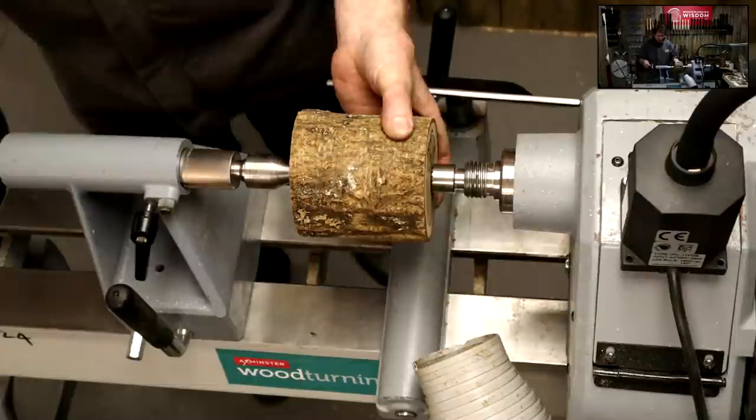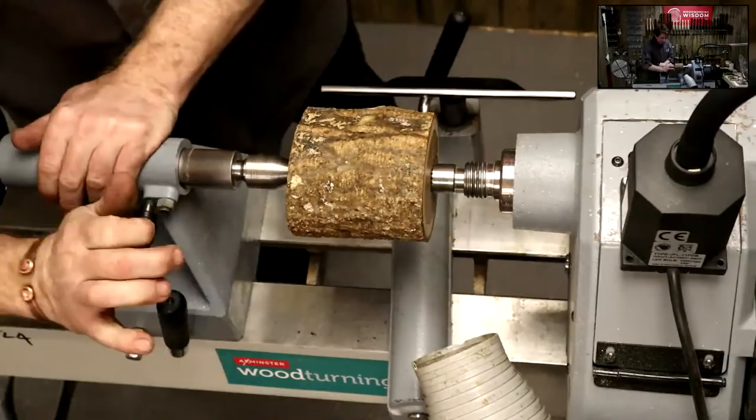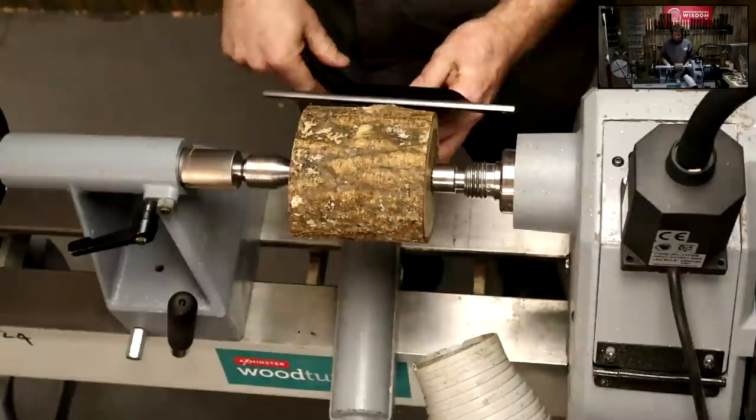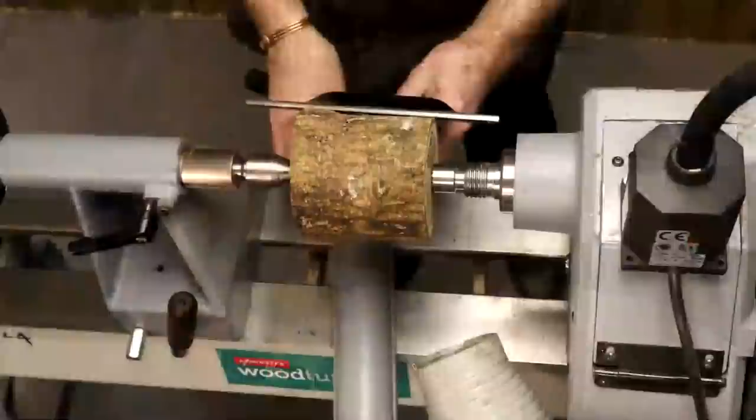Tighten up, get a rock with your hands, just see what's happening. If it's too loose you'll get a bit of play. Lock off everything handle-wise. That feels nice and firm. Tool rest - we've got one of those robust tool rests with nice clearance, which will be great for this. I want to be just below center height, about a quarter of an inch below. Turn the work over by hand to see what happens, lock everything up nice and firm.